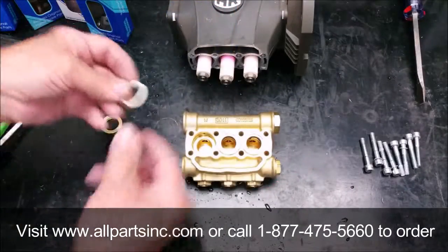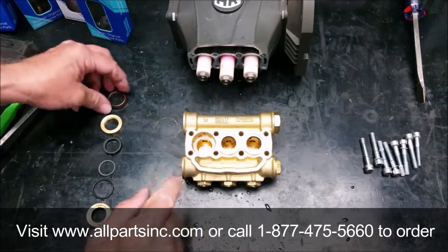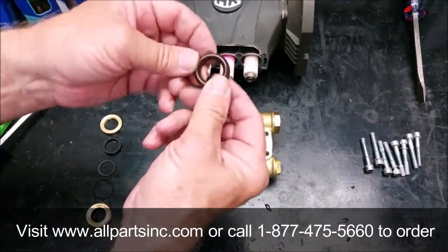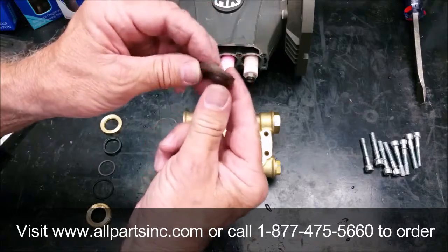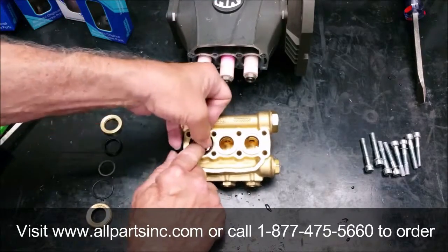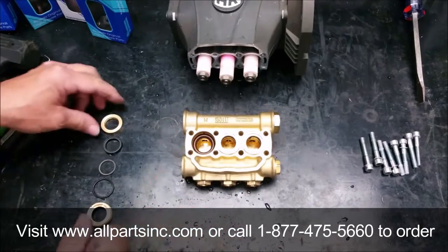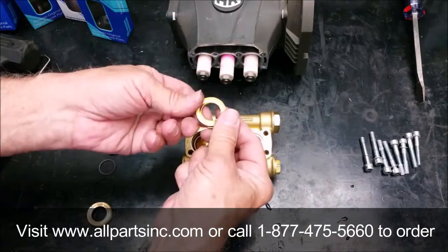The parts inside of the manifold start with the 3 support rings with their flat side down. Then comes the high pressure seals, which you have to firmly press in. Put the high pressure seal in at an angle and work the edges in. On top of that is the front piston guide with the arched side down.